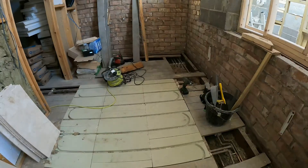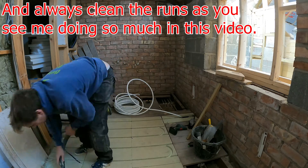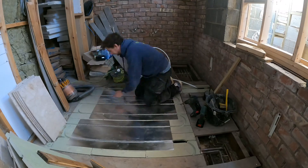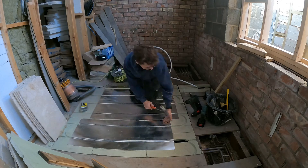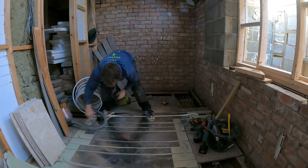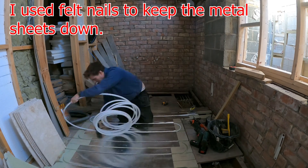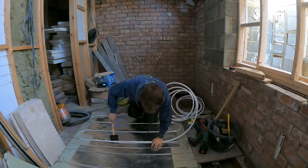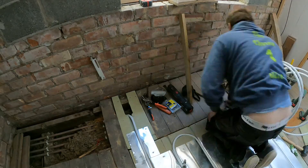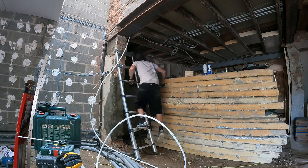You see me here measuring out and calculating the amount of pipework I need to pull through the floor. I pre-calculate the number of runs needed, then simply pull the piping through. I then fit all the metal sheet — this sheeting is required and really grabs the piping to keep it secure so it doesn't flex up. I use a rubber hammer to hit it in better. The metal sheets also act as a thermal pad, reflecting and pushing heat up from the pipe work.